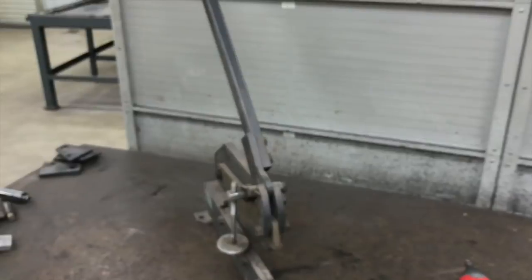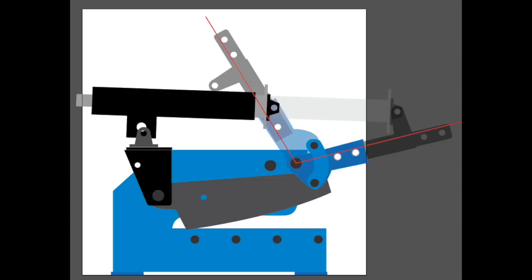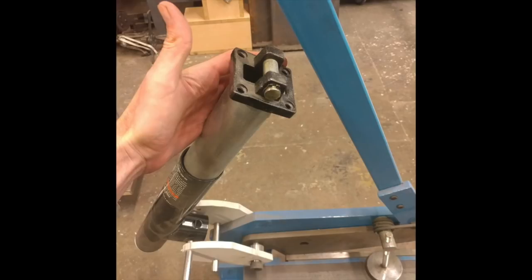Eco Mouse Design and I have been kicking around the idea of turning this into a poor man's ironworker. The thought is we'd use some plasma-cut pieces along with a trailer jack from Harbor Freight to do the linear actuation — those are really cheap. The idea is that this could be turned into a DIY kit or DIY plans. The trailer jack along with one of those Harbor Freight pipe threaders to turn the trailer jack, and a foot pedal, would basically turn it into an ironworker-type operation.